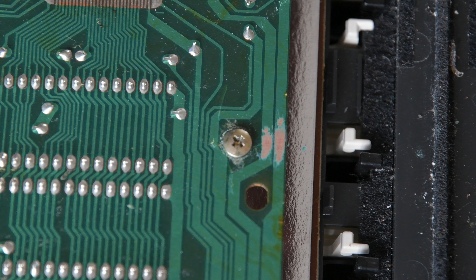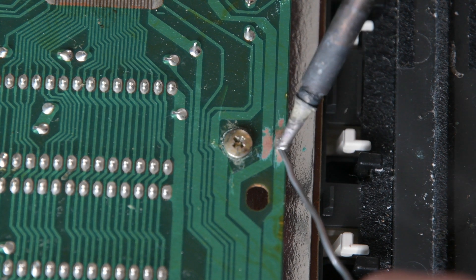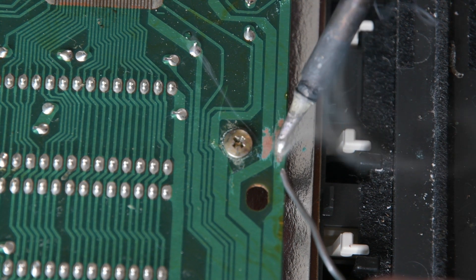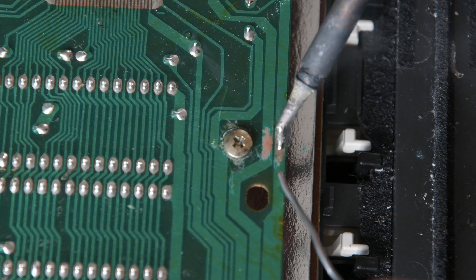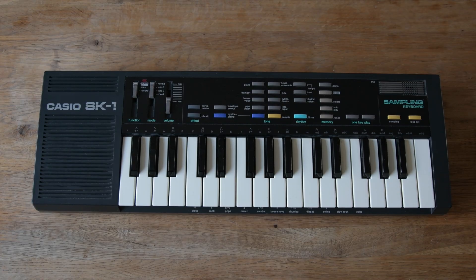Once more I'm going to remove the paint and solder across this to jump the connection. I feel this creates a stronger bond between the two halves, and if the break is due to a crack it's going to stop that crack growing. I believe this screw might have been over-tightened in the past, cracking the board — the plastic post is snapped off at this screw and that's why it's still in the board. Okay, so we've sorted that, let's turn it back on.